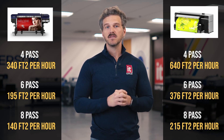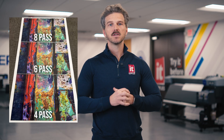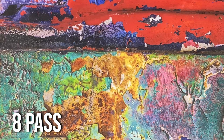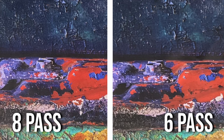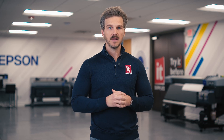It's not hard to see that the S9170 is significantly faster than the Epson S80. But what does the print quality look like in these modes? We have three samples printed on Epson GS canvas at 4, 6, and 8-pass modes. We're going to pan across the different samples to let you compare these for yourself. The 8-pass is the most dense and vibrant, but it is honestly really hard to tell the difference between 8 and 6-pass if you aren't really looking for it. 4-pass has a perceptible step down in ink density, and if you're really looking, you might find a little bit of banding in the dark solid areas. But honestly, if you shipped me this canvas and I never saw the other two, I would be happy to put this up on my wall. To think that this was printed at 4-pass and 640 square feet per hour is pretty insane.